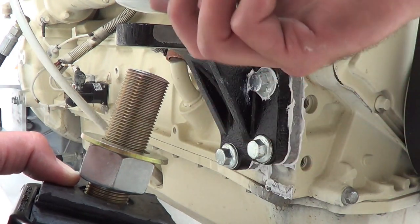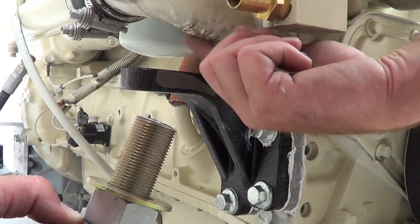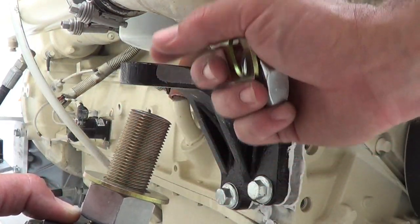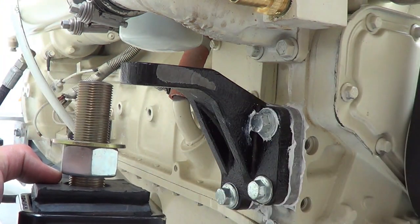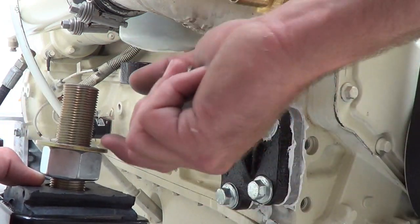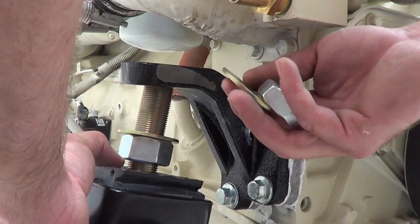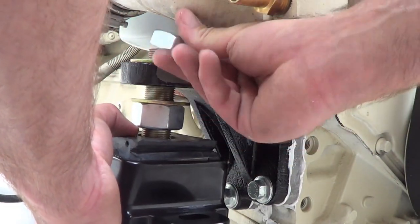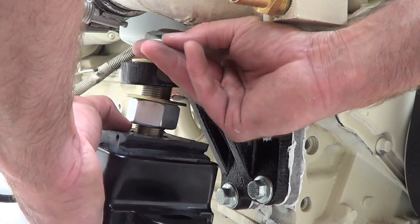In this case, with this construction here, we had to cut about an inch and a quarter off of this isolator stud to make it a little bit shorter. We could have just lowered the bracket down and let the motor ride higher on the isolator, but we thought it better for resisting vibration and for general stability of the motor to have it a little closer down on the bottom of the stud.